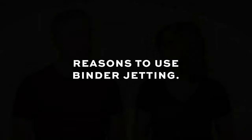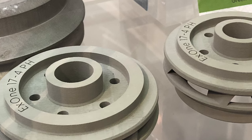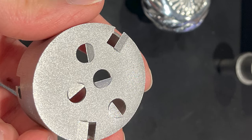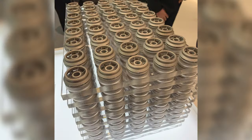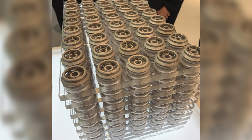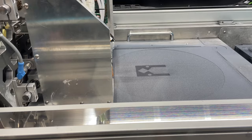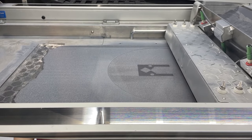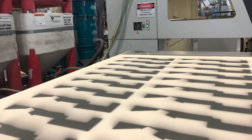Let's talk about reasons to use binder jetting — there are a lot of them. It is a way to 3D print in metal without melting, which expands the range of metals that can be easily 3D printed in a more controlled process because there's no phase change. Because there's no melting in the printer, you often don't need support structures; parts are supported by the loose powder during the build, and you can nest them in three dimensions, packing a lot into a single print. Binder jetting is also a way to 3D print with very hard materials that might be prone to stress cracking in a different additive process involving a big temperature change. Another advantage is that powder not touched by the binding agent is essentially the same material coming out as went in, so recycling and reusing the material becomes easier.